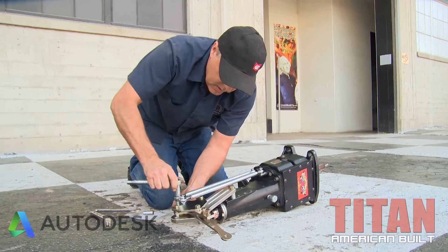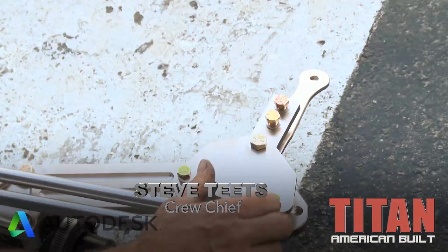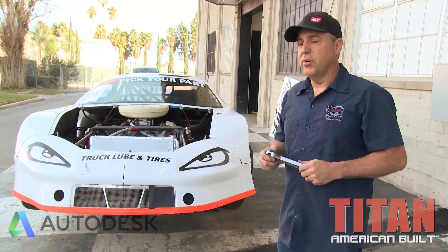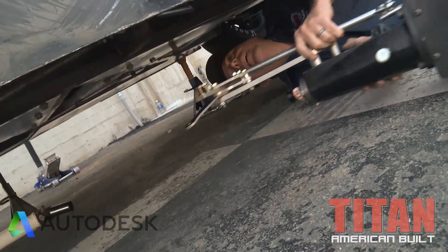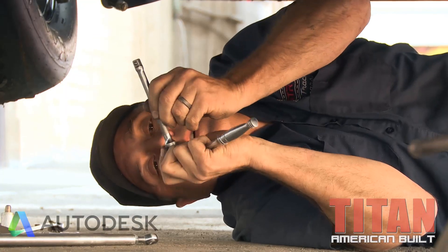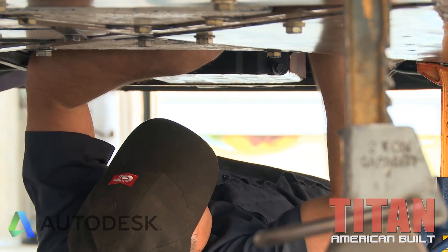This part is awesome — Titan brought it and we've got it all assembled. I just installed the shifter on the transmission. I had to adjust the rods to get the shifters all lined up perfect so he knows where neutral is. Now all I've got to do is put it in the car, slide it in through the boot, get it all bolted together, and we'll be ready to rock.